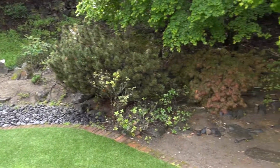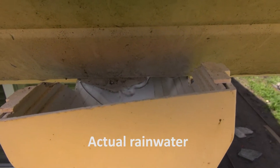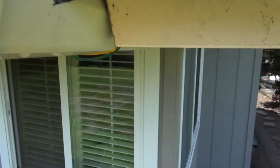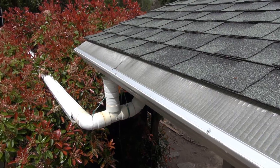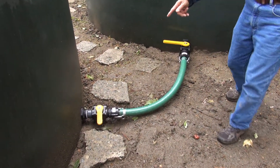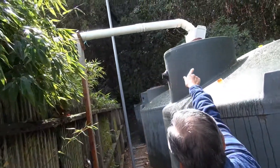This summer, on a hot year, we will use the whole 15,000 gallons. I may increase the system by adding one more tank because the catchment on the roof should support it. You have the gutter where the water gets in and is channeled down to the water outlet. On one side of the house where the roof comes down at an angle, it's diverted by a rain gutter that goes across the house into a manifold, which feeds this side of the house and then goes directly into the tanks. The tanks are daisy-chained together so that water seeks its own level — when one tank fills up, they all fill up at the same level.